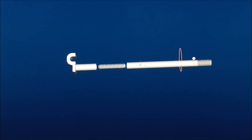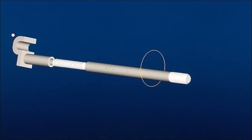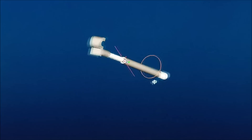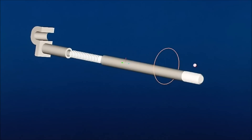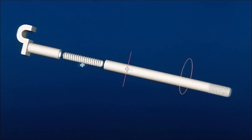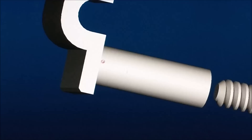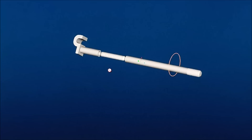I'm going to take the long threaded part on the end and make that out of one-eighth inch diameter brass — internally threaded. On the top piece I'll use the smaller diameter stock I'm allowed to use, create the hook, and screw them all together. At the end I'll have a solid unit that serves the purpose just fine. I probably won't show making the threaded part since you've seen me do it many times. How many of you guessed I was going to segment it and thread it into an assembly? I initially thought about connecting it at the head, but that section is only about a millimeter thick — I didn't see a viable way without counter-boring, counter-sinking, and brazing it. This will all be one solid piece when I'm done.